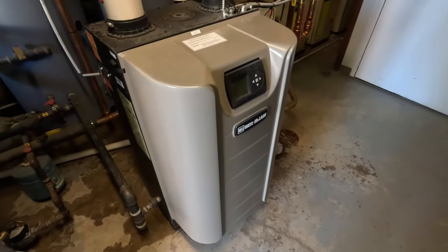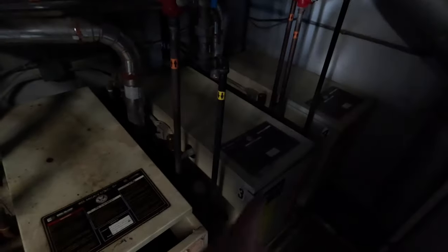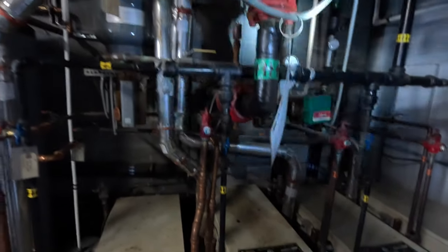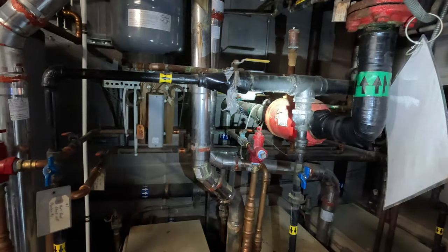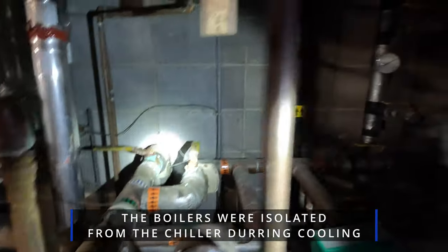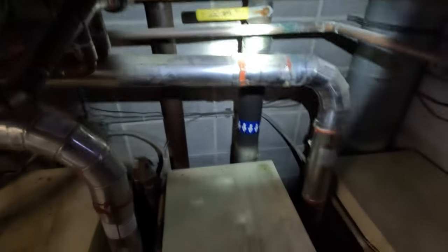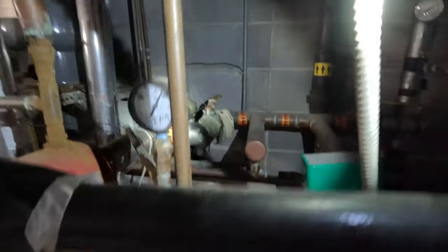You've got a boiler here that does hot water into two reserve tanks, you got four boilers here - these are what they use to heat the building. This hodgepodgery of piping, along with circulator pumps and stuff like that, took a little while to figure out. They've got some of this marked with green, yellow, and blue tape telling you which way. The chiller comes through this direction, comes up and kind of goes into this manifold here. This manifold is going to get isolated - I closed that line there, but I'm going to close it as redundancy.